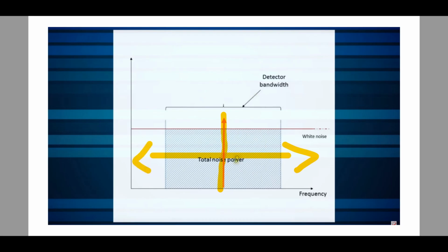So if your signal is very small, it can get easily buried in the integrated noise of your detector as well as your instrument. For example, the detector noise can be so wide and can be so high that the peak-to-peak value or the RMS value of the noise can be much higher than the signal of interest, so you couldn't distinguish them from one another. And this doesn't even include noise coming from interference and other things that could be present in your system. So how do we solve this problem? How do I get my signal out of my noise?